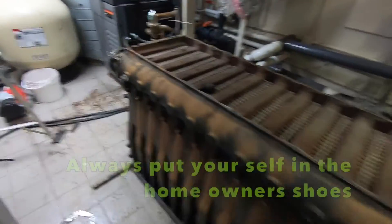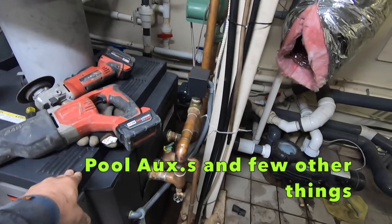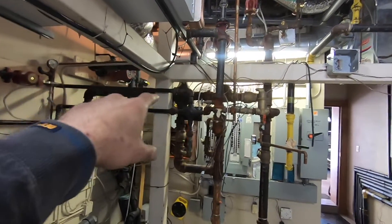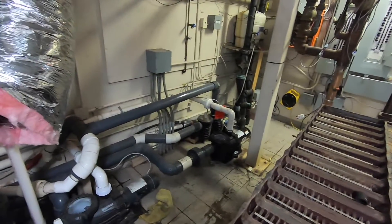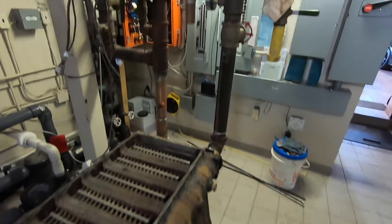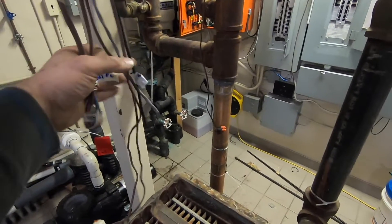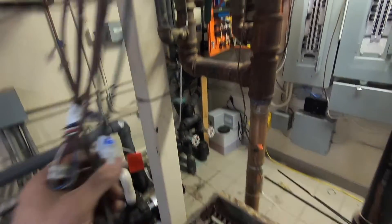Alright guys, gotta always think of the home water. So this does the pool heat. What I'm gonna do is tie this in to the domestic water over there — just run some PEX over, so while we're doing this whole setup they'll have domestic hot water, take a shower and what not. I'm gonna start separating these plates, hopefully I'll have some good luck there. The other thing is labeling wires — you can't just cut everything. I had a box of sensor wires, gotta label them, make sure I know where everything's going — all the floor sensors, outdoor sensor.